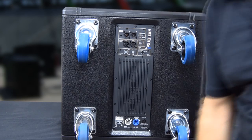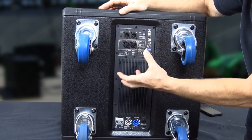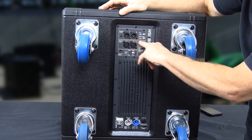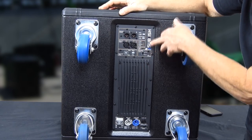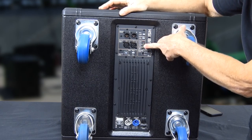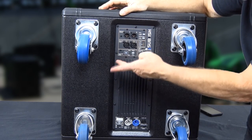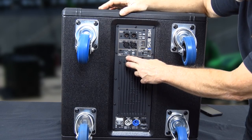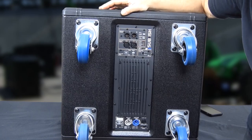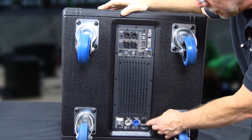Now we're around the back side — here's the amplifier module. We've got XLR inputs for stereo in, channels one and two. Crossover is selectable at 90 and 120 Hz. Outputs can be set to link or crossover mode. Indicator lights include red for limiters, green for signal, yellow for mute protection, and green for ready. Mini USB data port, level control, phase reversal at zero and 180 degrees, and up to 4.5 milliseconds of delay for cardioid sub configurations. PowerCon in, PowerCon out, and fuse protection readily accessible.